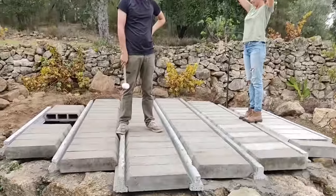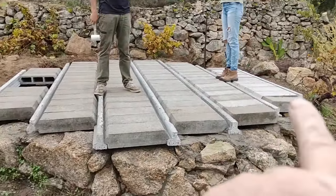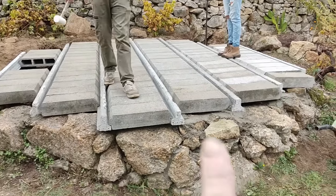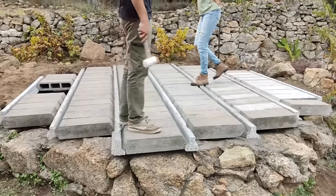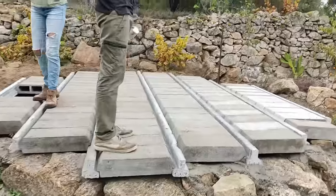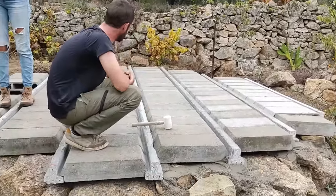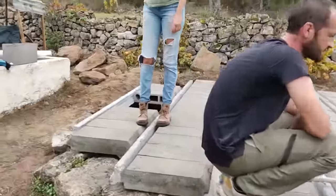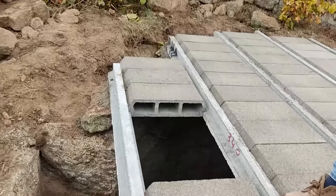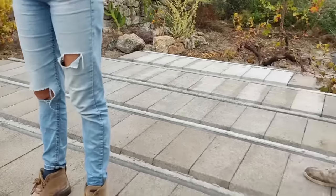So there we go, top on. Bit of work to do yet. We've got to fill the outside edges. I think Ewan's going to put a ring of granite around, a bit higher, all the way around. And then we've got to put 100 mil of concrete on with steel in it, height of that hammer, really, and a trapdoor behind Carissa there for easy access. It's going to be another trapdoor, like a boat cabin door there. But yeah, all good.